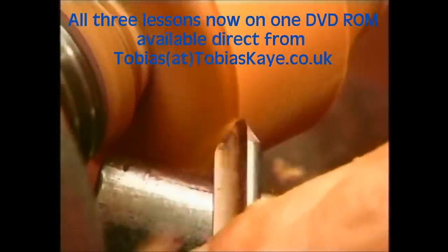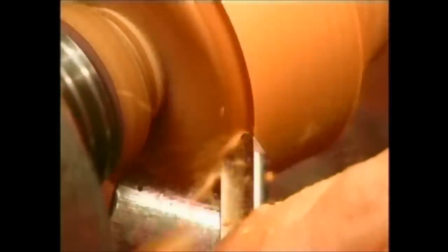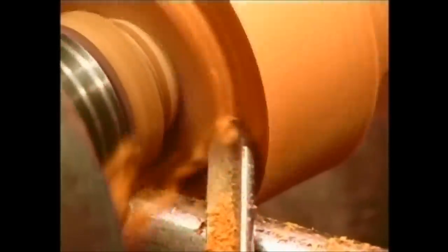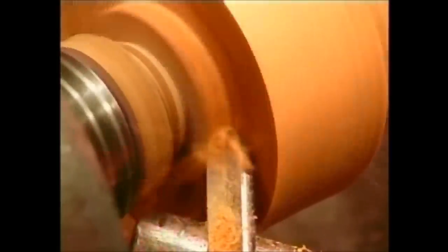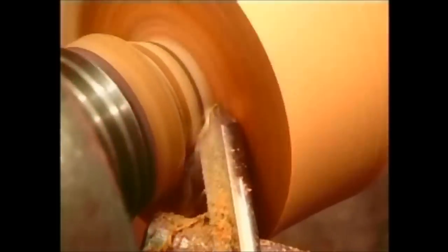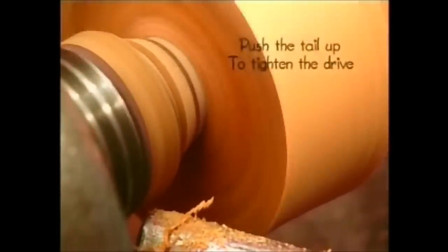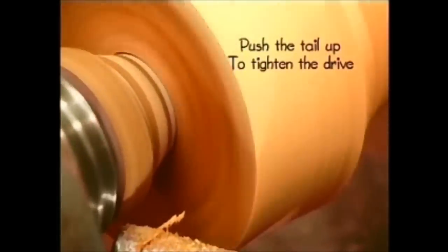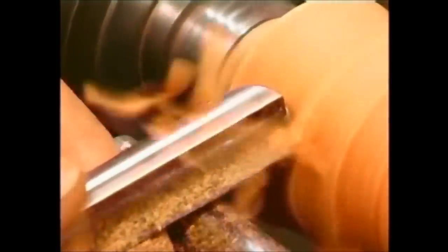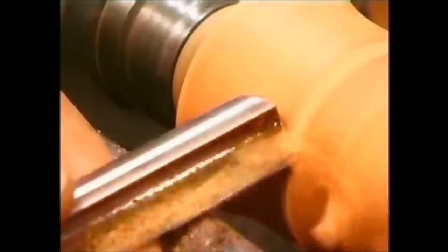Before refining the shaft shape, cut the top profile. Sometimes the piece will run slightly out of true once this is cut. The same type of cut with a spindle gouge is used here as was used across the base, leaving a little dish to catch wax runs. It may be necessary to use the point of a skew to clean up. At the top, some simple detail helps, whether it just flares out or has a sort of thistlehead shape like this.